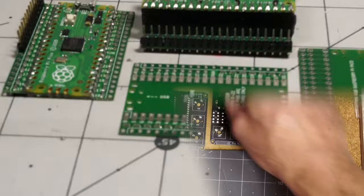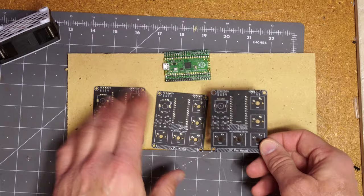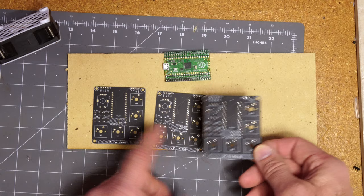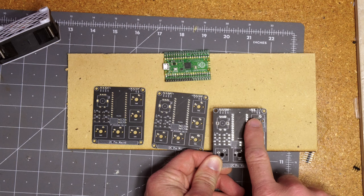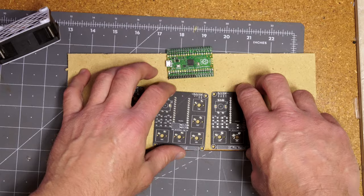So to show off my Pico Touch 2 board, what I'm going to do is make basically a macro pad out of these unused JC Pro Macro 1 macro pad PCBs. Basically what I'll do is put one of the GPIO pins to what would normally be the plus 5 volt area, which covers most of the surface with a copper layer. So it's going to use this as a conductor — you hit it and it'll do different things. I'll just have to put a connector on here and here.